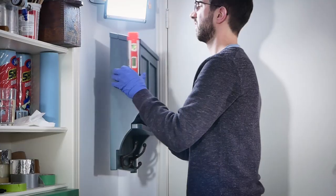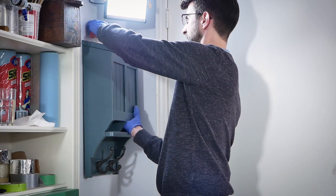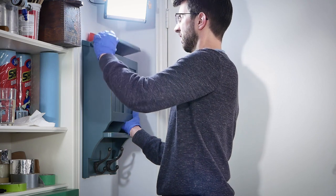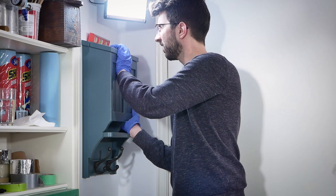To mount the cabinet on the wall, I had four pre-drilled holes with screws partially screwed in so that on the back the tips of the screws were poking out a little bit. I put it up to the wall with a level where I wanted it and I just gave it a little shove to mark those screws into the drywall.